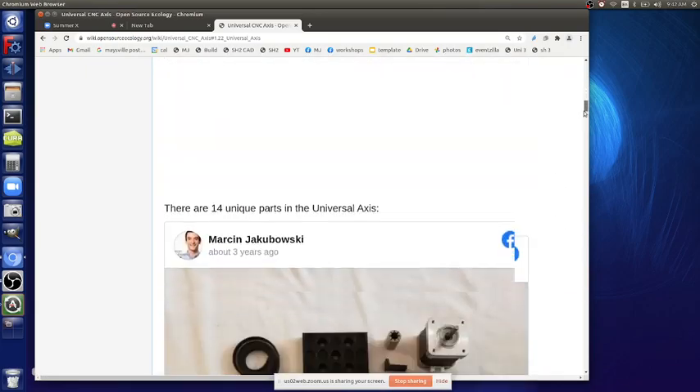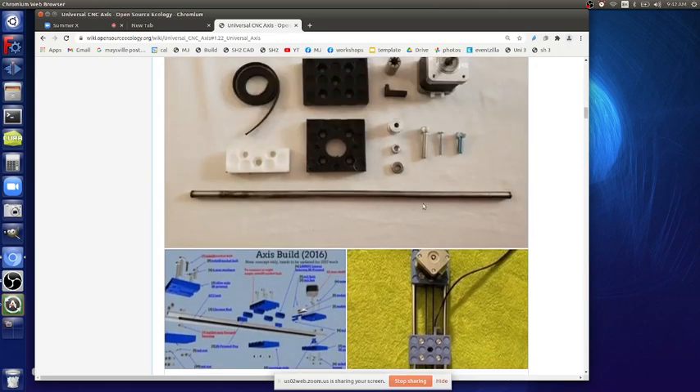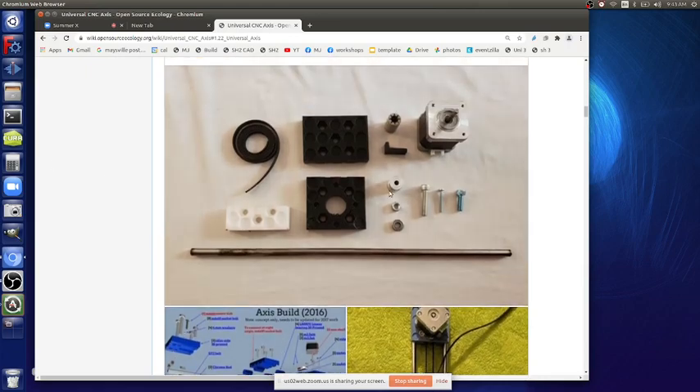The initial design looked complex with lots of parts, but we've simplified it significantly. We started with clamshells — bolting clamshells together was a pain. The idler piece alone used two clamshells, four bolts, four nuts — about ten pieces. We've reduced that to one full shell, one piece. We thought clamshells would give flexibility for disassembly, but in practice you don't really take off one part — you take off both when modifying something.